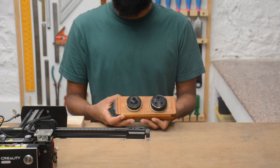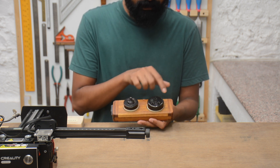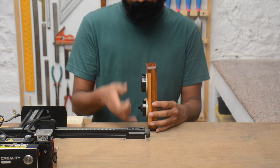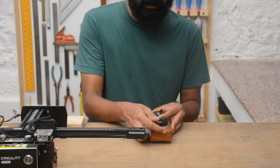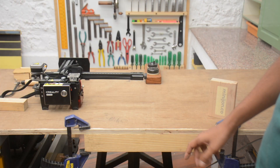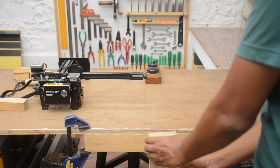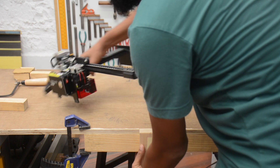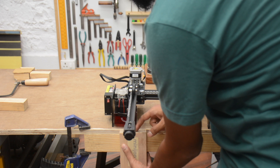Now the fourth tip. This is another one of my products that I sell through my website. If I have to engrave a logo over here I just have to remove the switches and I can do that. But if I have to engrave something along the side then it poses a problem because this height is too much for the laser engraver to keep on some temporary supports. To engrave that surface I will show you a small quick-to-make setup. It's just a block of pine that I have clamped to my table surface, and now I can clamp my work piece to this block of pine using two clamps. Then I can just keep my laser machine on the edge and make sure that the engraving area coincides with the location of this block.